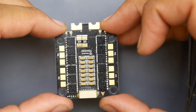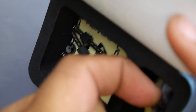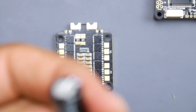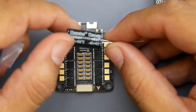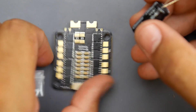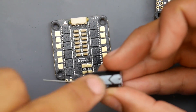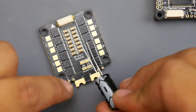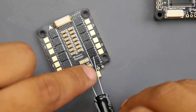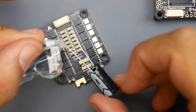If you are running this on 6S, you definitely should add the provided low ESR capacitor — keep that in mind. It's a really nice, fat 1000 microfarad, 35 volt capacitor. I've tested these before and they're pretty good. To add this, with the power going in and the wires going to the XT60, look for the dash line — that means negative. Solder that to the negative pad and the positive to the positive pad. You solder that alongside the battery wires, and just make sure it's not sticking out. That's it for the ESC.